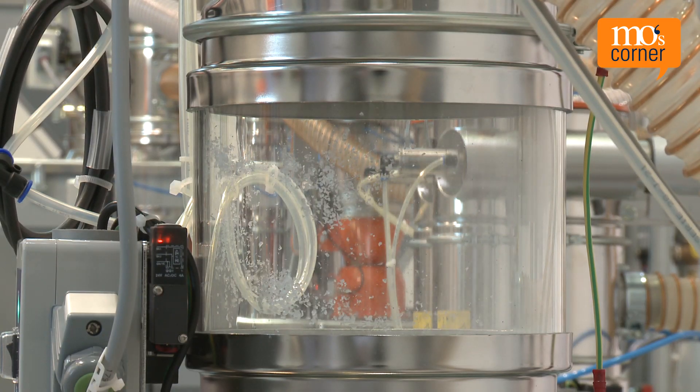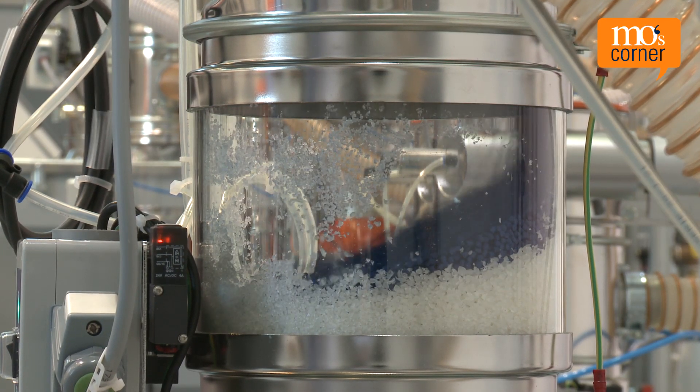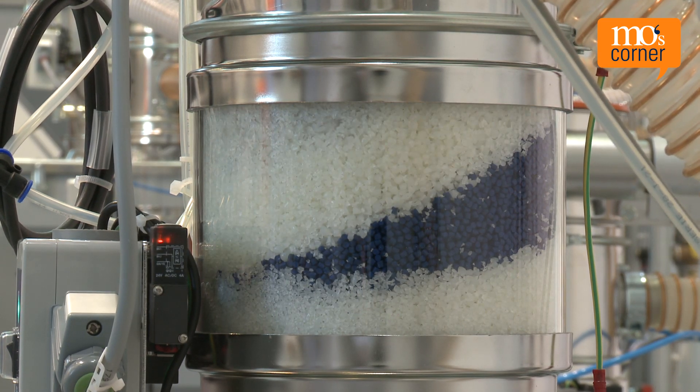The variation using a material sorting gate is normally only used when there is a large permissible range for the adding of re-grind and proportion of any additives being used. This two-component gate feeds the actual resource on one side and on the other re-grind from the sprue mill. Re-grind can be fed back into the processing process directly and can therefore be an important component of the entire process.